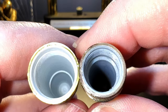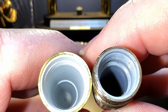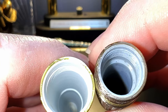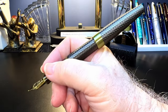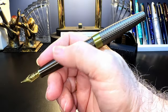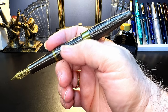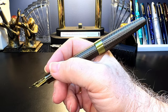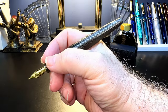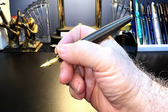We can also see the intricate sandwich construction of the 3D layers. The inner liner of both the barrel and the cap is a slightly softer PLA plastic that allows the threads to slightly deform around each other to mesh rather than wear — excellent engineering that will allow this pen to last. The cap posts deeply and securely, and in the instructions Michael gives a tip to slightly twist the cap to make it very secure as those cap threads engage with the barrel. Because the cap threads PLA is softer than the barrel PLA, you won't mar the barrel when you do that. Although posting the pen makes it slightly long, the cap weighs next to nothing so it doesn't unbalance the pen. Unposted, the pen is plenty long enough and very comfortable in the hand.